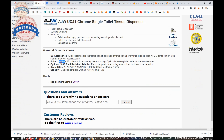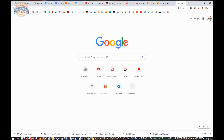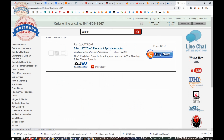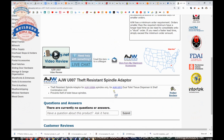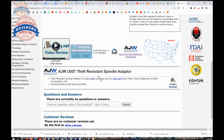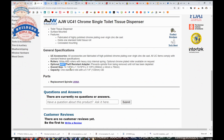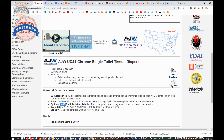The replacement spindle is available here — nice to be able to find the replacement spindle for this item. They can also do a U007, which is going to be a theft-resistant spindle adapter. That U007 basically prevents you from removing the spindle until the entire roll and core is exhausted. It sets over your spindle, and there is a video of it here that you can review. Your spindle will sit inside of it, eliminating the ability of depressing it until you are completely exhausted of toilet tissue on the dispenser itself.